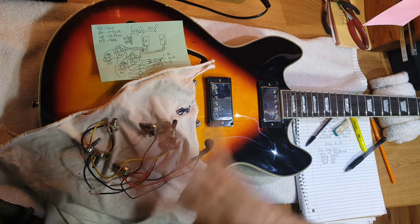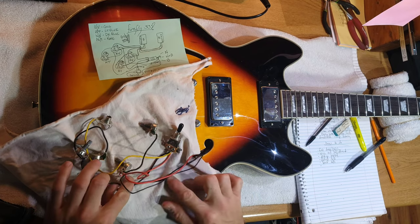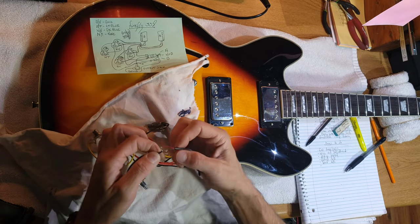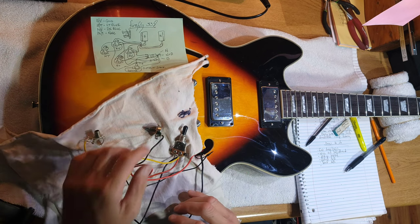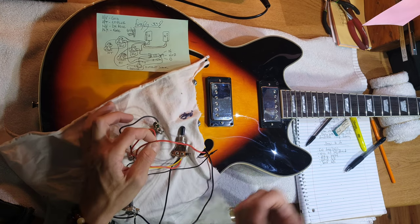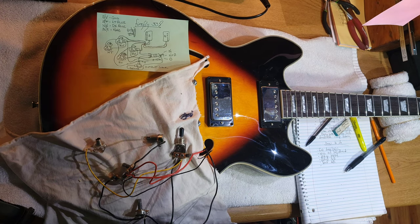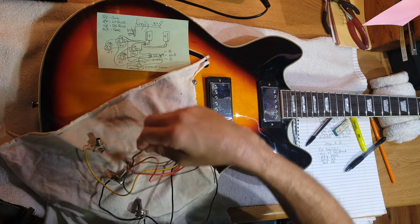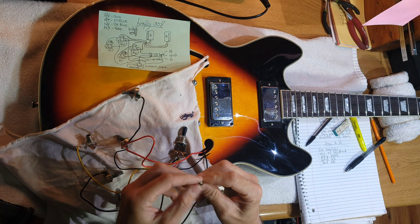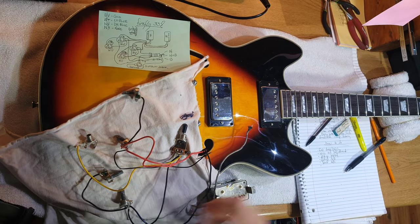As far as this configuration — which I'm not used to — this is the bridge pickup, which already has a junction right here. So I'm just going to desolder these and resolder the new pickup. For the neck pickup, I'm going to create a junction there — just snip that wire so I'll have them for both, and in the future I could reconnect them if I needed to change them out. The new pickups are only two-wire pickups, so I just have to connect the ground and the lead. Easy as that.